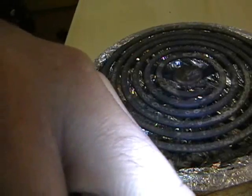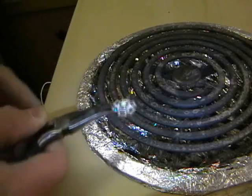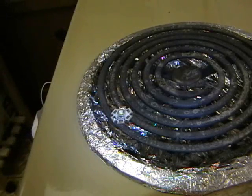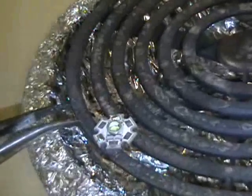Once you've cooled down just a little bit to medium high, take your star emitter board and place it on the coils. Give it a few seconds or so and you'll start seeing the solder start to bubble and percolate just a little bit.